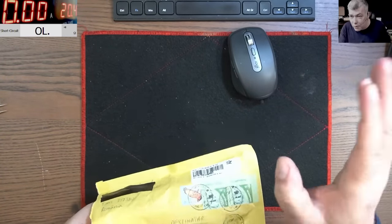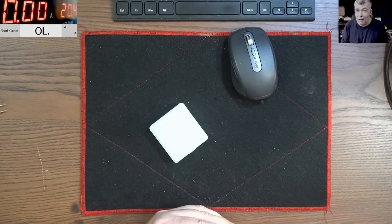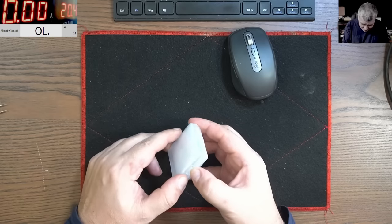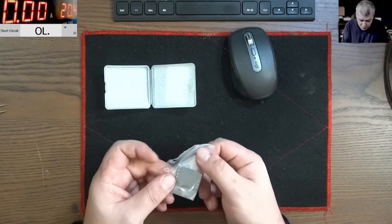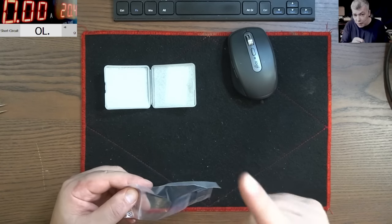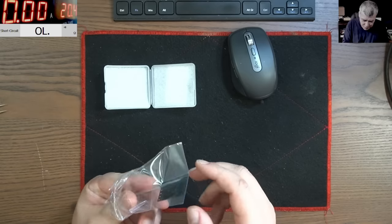Now, this is a special job. And why do you think it's special? It is special because I hope this chip doesn't work. Yeah? I hope so, so I can test my tools. This was one of the reasons why I bought the SVOD programmer and all the adapters, so I can actually program this chip. If you don't have those adapters, you cannot program the EC chip on this specific laptop. So we have the I/O chip here.